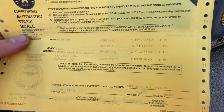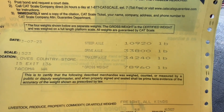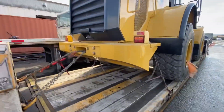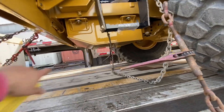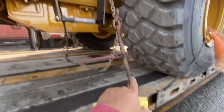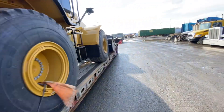Okay guys, got to the scale. As you can see, I'm all legal — that's good. It's almost perfectly placed in the middle. I still have diesel to put in, so it should balance out perfectly. Let me show you how I tied it down. I changed those two crossing chains because I didn't want to damage the fuel tank of the loader — the crossings were too long. This trailer doesn't have too many rings, so I decided to run chains straight down to the trailer, with one more at the kingpin.